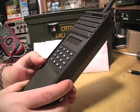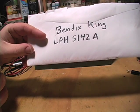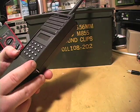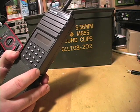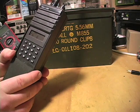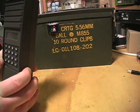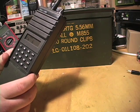This is a Bendix King LPH5142, written right here. This should work pretty much for any of the LPH series radios. Now these are ruggedized two-way VHF. Out of the box they do 148 to 172 MHz — 16 channel wideband only radio, which is one of the reasons why they've kind of been phased out. However, they're really easy to down-band to 144 MHz to work on the amateur two meter band. You can find them as low as ten dollars, more typically twenty or thirty dollars on eBay.